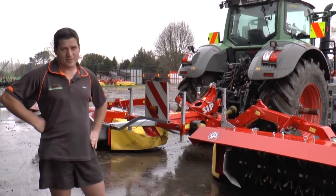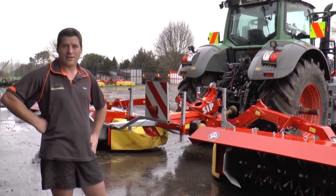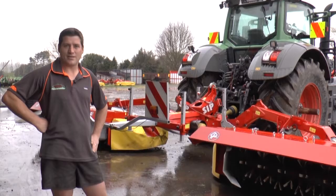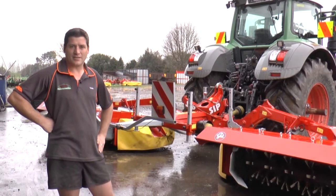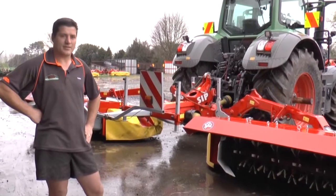The shear pin system works excellent. On the stony ground we've had a few times where very large rocks have caught the mower. It's just as small a damage as the shear pin, so that's easy to fix — a ten minute job. It doesn't happen every day; it's only once, twice, three times a season if we're lucky. And it protects the bar.